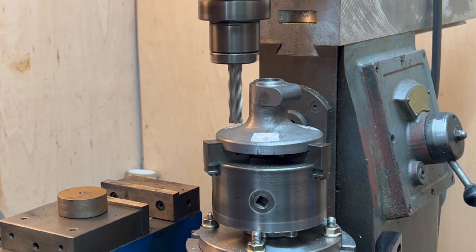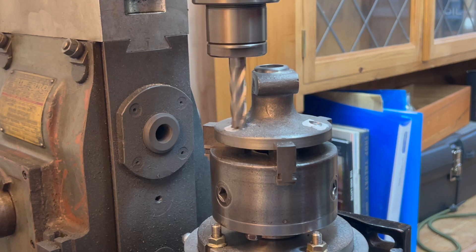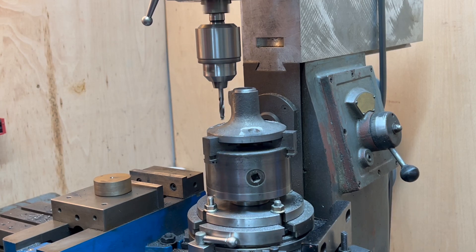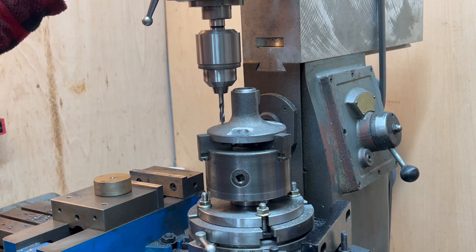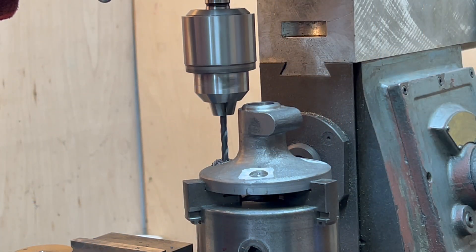We've got to get the base on the rotary table. We're going to be spot facing for the three fixing holes for mounting this to a piece of wood or the workbench, just using that rotary table. Again it's probably the first time I'm using this in actual anger, at least in this way. They seem to go pretty well. We're going to spot drill down into those spot faced areas and then go down pretty slowly with the drills to open it out.